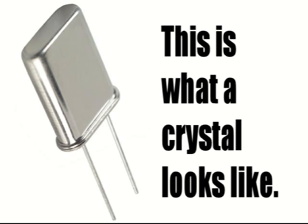What we're going to do is open up the CB radio and pull out the existing crystal inside of it. All digital CB radios use the same frequency of crystal inside, which is a 1.73 megahertz crystal. We're going to replace that crystal with our 6.5536 megahertz crystal. Replacing the crystal inside will actually triple the frequencies, and it just happens to put CB radios in the range that drive-thru restaurants broadcast on.